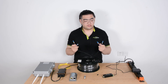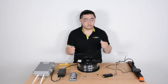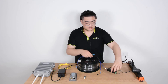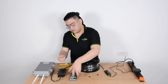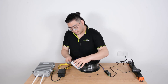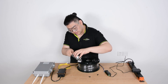On the fiber optic cables, we have dual lanes. We have to make sure that when using only one of them, they correspond on both ends. So on one end we choose line A, and on the other end, line A as well. Once we plug it into the first SFP module, on the other end out there we put the fiber optic SFP module into the media converter, then plug in line A to that media converter as well. This should set up the connection.